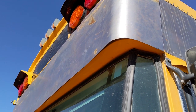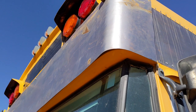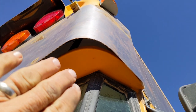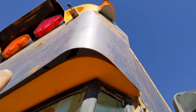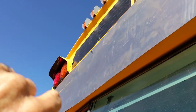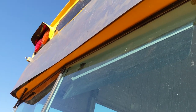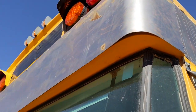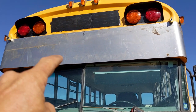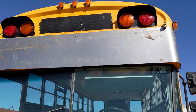Yesterday, when it was super windy, I rolled these edges around a piece of pipe, and they are not exact, but that wasn't quite the goal yet. I can tweak these after I get it scribed into place, but it's pretty close. It's close enough I can scribe it. The weight is actually hanging on that screw there, and then these magnets are just there to hold it in position, keep it from rocking side to side. So we're pretty close. I'll go inside and mark the inside curve and then cut that. And then we should be pretty close to putting that in place.